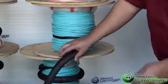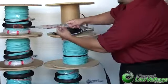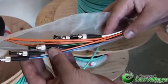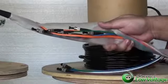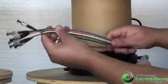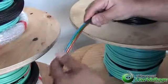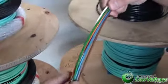I want to give you guys another view of what else is under this pulling eye. Under the pulling eye, we stagger the connectors. That's how the connectors are going to look underneath it — staggered, so the diameter is a little smaller, so when you've got to pull it through your duct you'll have a higher success rate. We also have furcation tubing that goes over all the individual strands, and it gets heat shrunk at the bottom, tied into the fiber with the Kevlar, so that way it'll also give each strand additional protection.